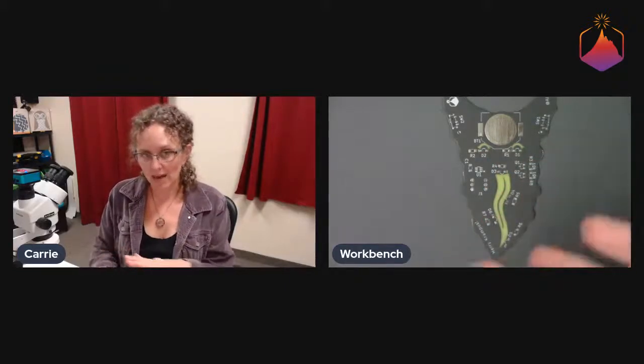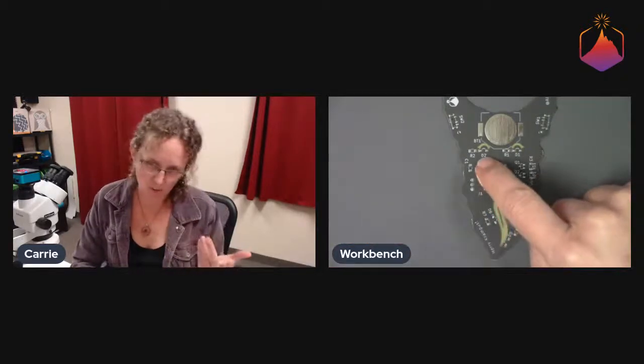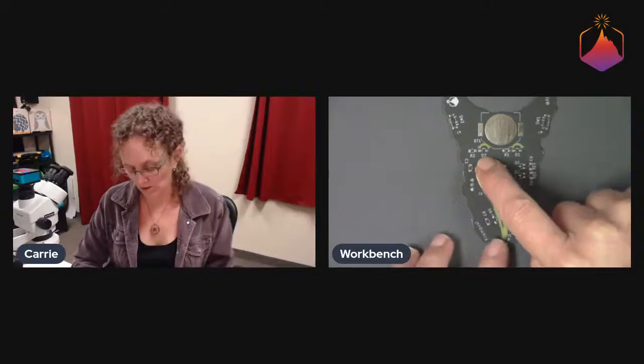So we're using these side mount LEDs that are a 1204 form factor. So they're LEDs that are on their side. The lens is made so that it's flat on both sides, so that it's relatively stable and not too bad to solder into place. And it's almost 1206 size, 1204.